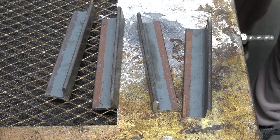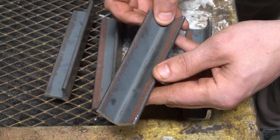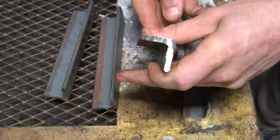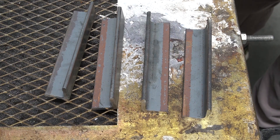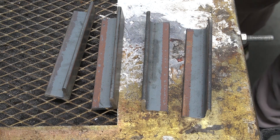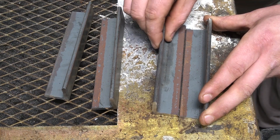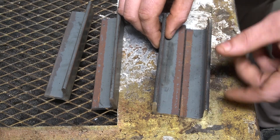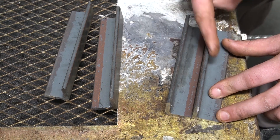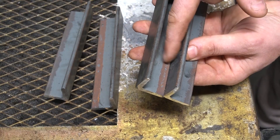Here are a few pieces of right-angled section made out of mild steel, chopped from the scrap bin. It's pretty rusty with no special features. Now, while there are lots of types of weld, we're going to focus on two today: a butt weld and a V weld. A butt weld is simply joining two pieces of metal together by butting them up against each other. A V weld, as the name suggests, does the same thing but the end result is a V shape — so you'd be welding in a gutter.